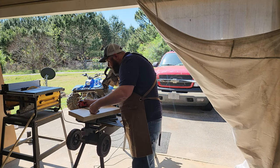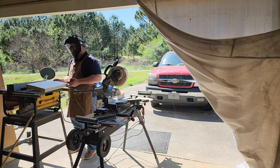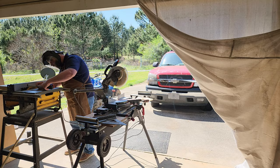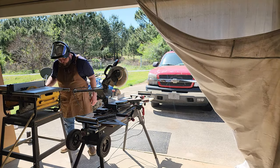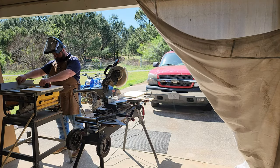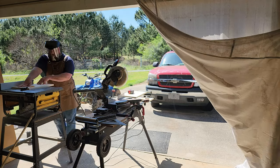Right here, I actually need to cut these down because the inside measurement of the board is going to be nine and three quarters inches wide on those legs instead of the original 11 and a quarter. So I checked my table saw and decided to go with the big end on the right hand side to feed it through, because that's actually a safer operation and I can stand to the side just in case something does kick.